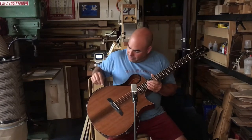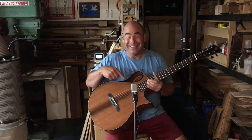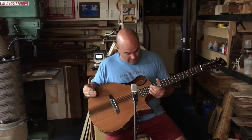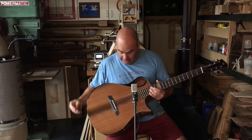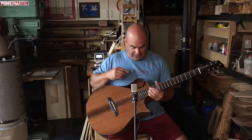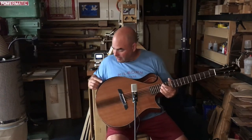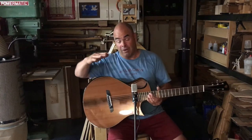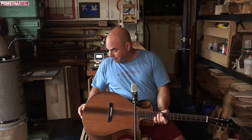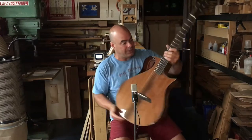This sound hole is the hardest thing I've ever built in any trade. These things are really hard to make because they have to be just perfect. It's actually made of three pieces of ebony that are laid in and joined together. It comes from a regular piece of binding here which is 80 thousandths of an inch thick, and it thickens up to about three-eighths of an inch, then thins again, with a chamfer that is reflected down below. What it ends up being is like half of a Möbius strip — half of eternity right here on the guitar.